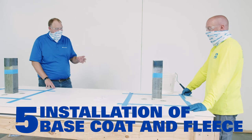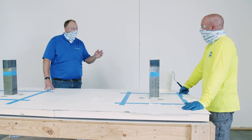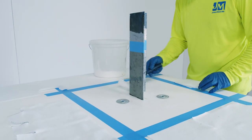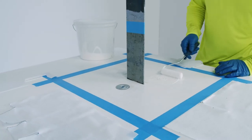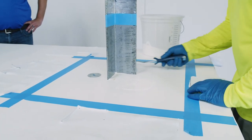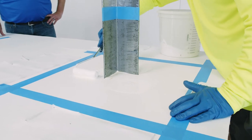We are back with step five of our single-ply liquid flashing installation, which is installing the base coat and the fleece for the actual membrane. As you saw in the breakout clip, we went through the mixing operation for the resin itself — just focus on getting the corners and everything mixed nice and consistent. The pot life should be about 25 to 30 minutes, depending on environmental conditions. We're trying to get to about 40 mils of resin below the reinforcement, and then we'll do another 20 or 30 over the top for a target thickness of somewhere between 90 and 110 mils, including the reinforcement. So right now I'm making sure I get a nice heavy base coat everywhere that those target pieces are going to touch.